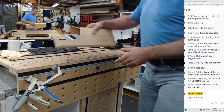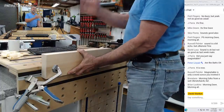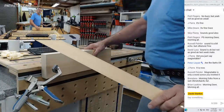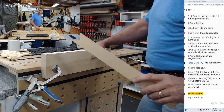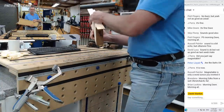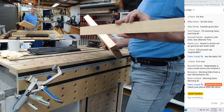So I'm going to plane this first, because one of the things we need to do is plane the edge first, get it nice and straight, because it's very hard to plane a nice finish like that after it comes off the saw. You can do it, but it's nice to have that. If you're wanting to use it to join on, not join it back to the board that it came from, but you understand what I mean? To get it to join back, to glue it onto a surface, you want that face, this face, planed up first.